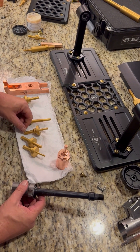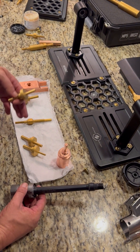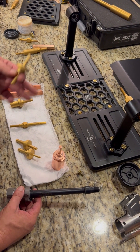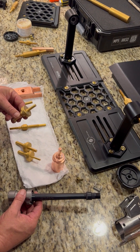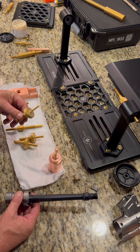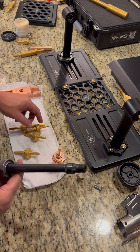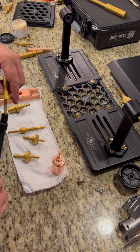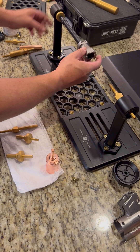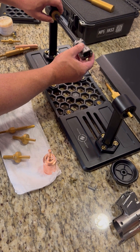One of the final sets of spindles are the spindles for supporting the front of the barrel. When your weapon is completely built and you want to be able to support it to weld up the cocking tube or what have you, you have the 7-6-2, the 5-5-6 spindle, and the 9mm spindle. For this one — it's a 5-5-6 barrel — it goes in and you would have it placed into the front. I'll go ahead and set this up so you can actually see it fully supported.